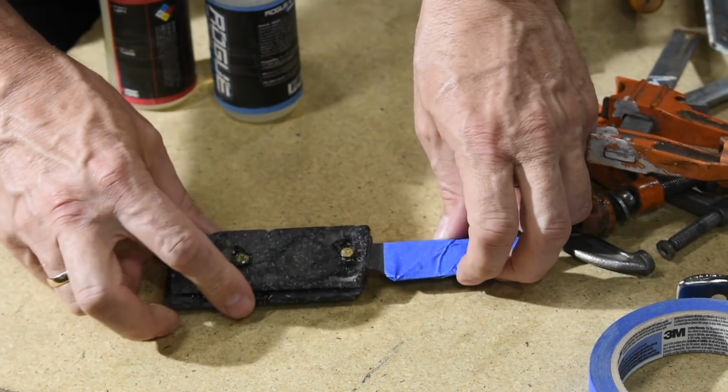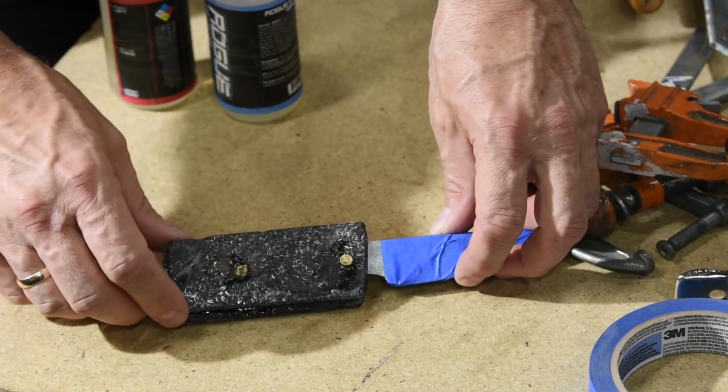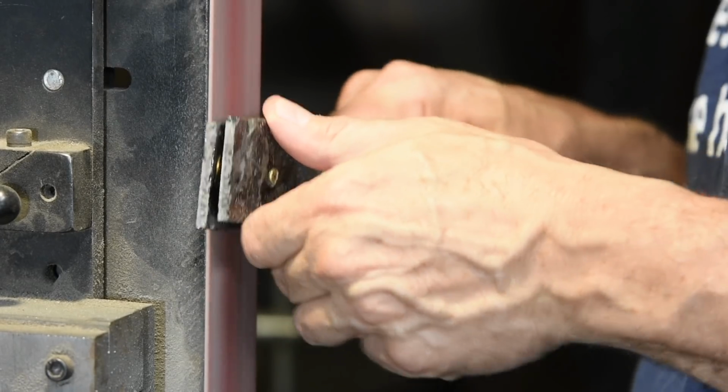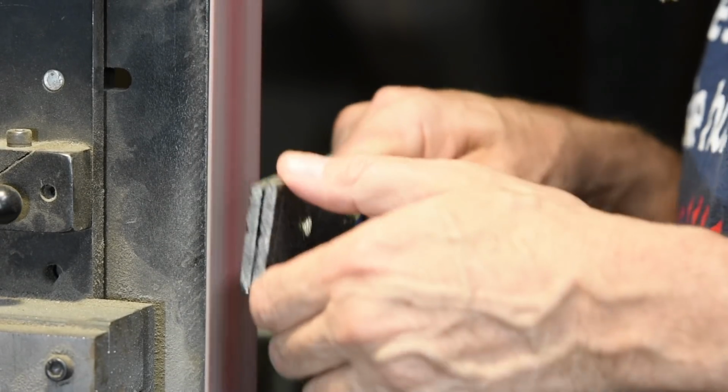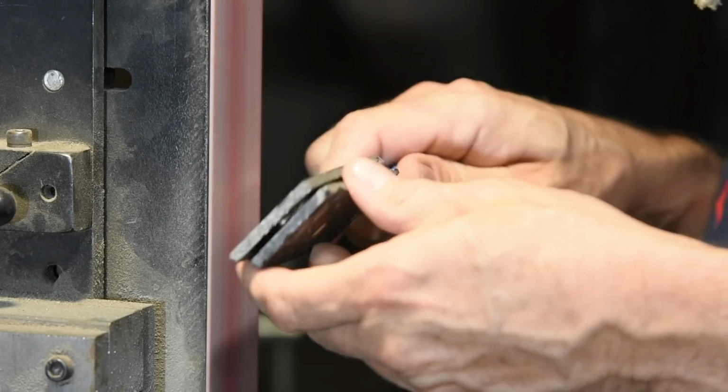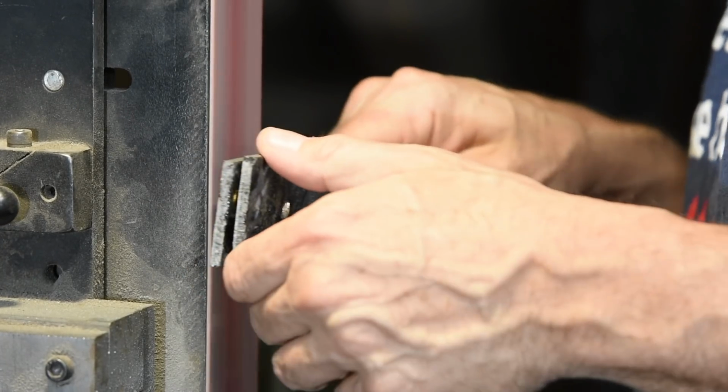Once the epoxy is set, it's back to the grinder to start profiling the handles and bringing everything to the final lines. I'll start with a 40 grit ceramic belt, moving in stages up to 220 grit. Then I'll wrap up with a 3M Gator Grit 65 micron belt.